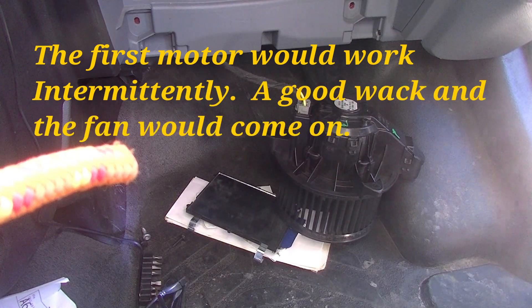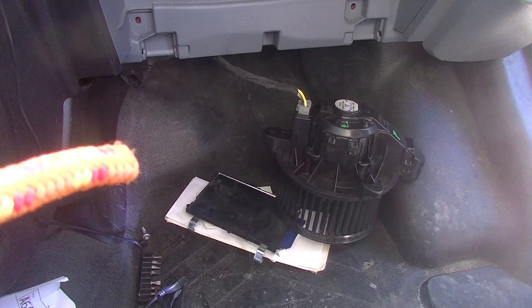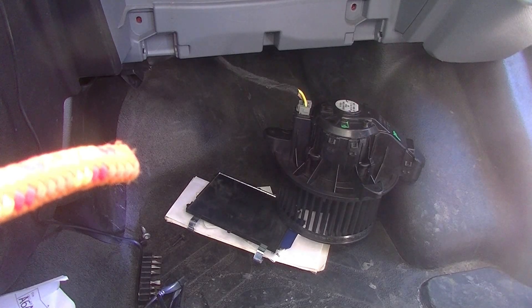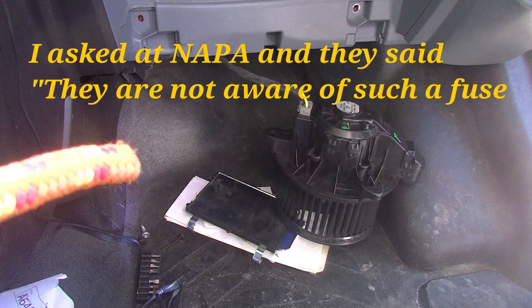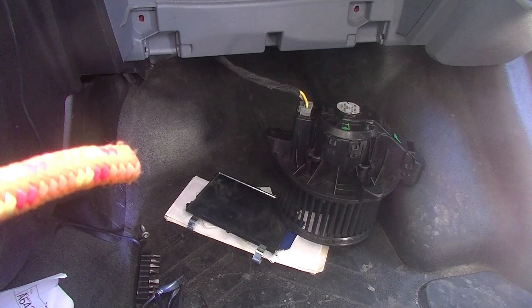It very well might be — the first motor could have blown it. We replaced it with a new one, but I also broke the fuse trying to pull it out. I'm thinking that chinesium fuse just couldn't handle the amperage — supposed to be 40 amps but it gave out. It might be a good idea to get some sort of relay or auto-reset fuse to put in there. All right, I've got to put this back and go inside and get warm. Thanks for watching, guys — I hope this helped.